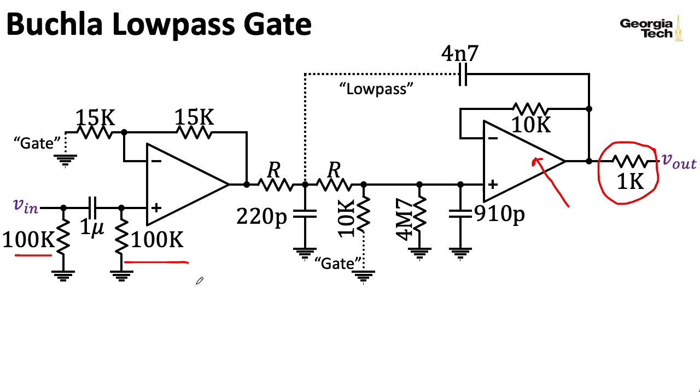As far as this op-amp goes, if the gate connection isn't being made, this 15K is out of the circuit, and we have this 15K in the feedback loop—but it's not really relevant, it might as well just be a straight line. So this is just a voltage buffer.